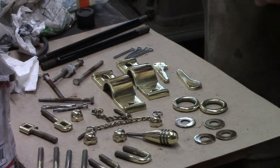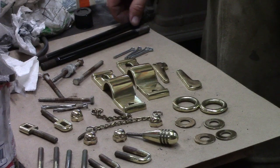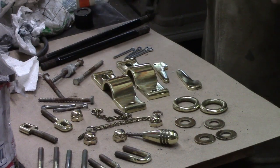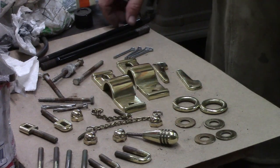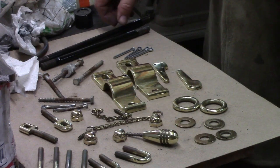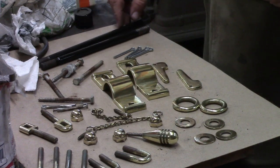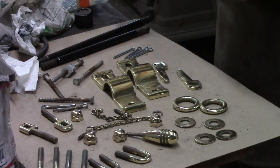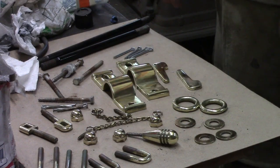And I did run the drill bit back through the holes because these were fairly snug coming out, so I ran a 1/2-inch drill bit back through the hole and kind of wallowed it just a little bit before I started the faux painting, and hopefully these will slide in easy and won't scratch our paint up. If it does, we'll just touch it up with a brush, but we'll have those. But everything's turning out okay.